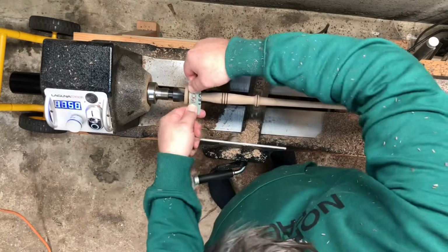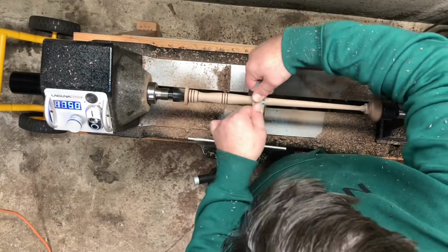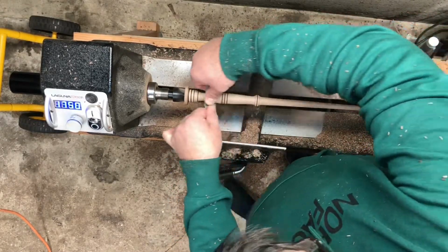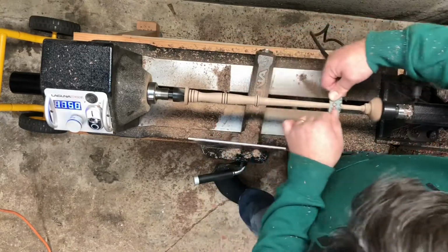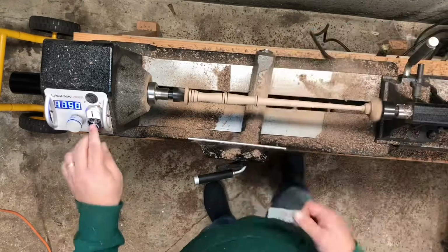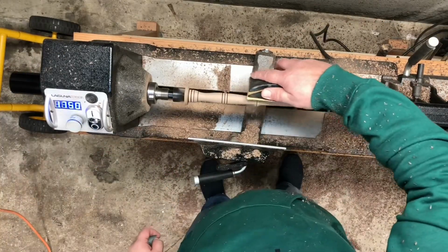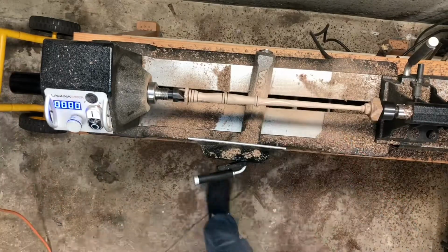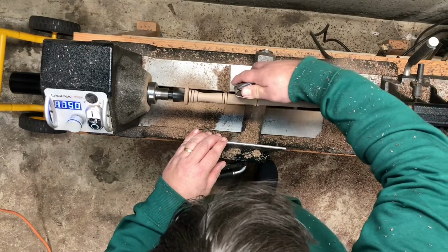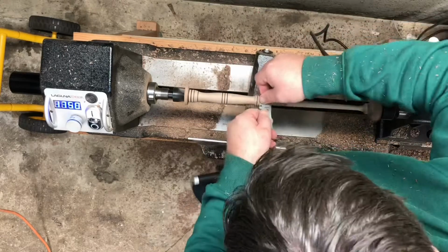All right, so I started writing on the back of my sandpaper here. I have 150 grit. It's pretty rough, but it gets rid of my first chatter marks, I guess they call them. Again, I'm not 100% sure, but right there in the middle I was having a little bit of a hard time, so I thought, I better take it down. This is 60 grit that I have on that block, and that's going to get rid of those marks a lot faster. Then I go back and touch it up with the 150.